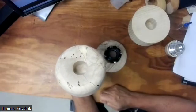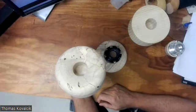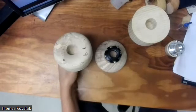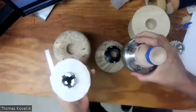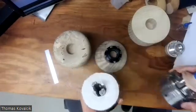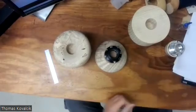John, at any stage in developing your process, did you ever consider grabbing that interior bore with a chuck or an expansion collet and doing the bottom as a continuous surface? Yes, I'm getting there. Good question though.